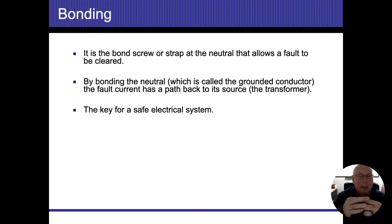They'll put a hydraulic tool on two pieces of wire and they'll squeeze the living daylights out of that thing until they meld it into one wire, all right? So there's no screws, there's no mechanical connection. They just squeezed it and basically made it into one wire. You would have to literally cut it with cutters in order to break that connection again. So if we could break a connection with a screw, it's wrong. If we have to cut it, then that splice is okay. And those splices don't have to be in a junction box.